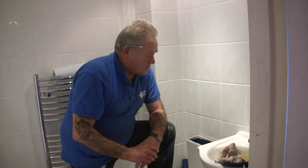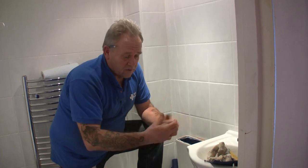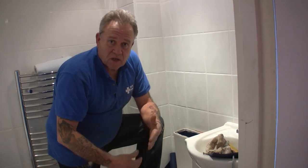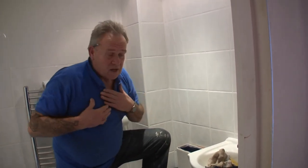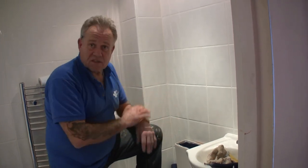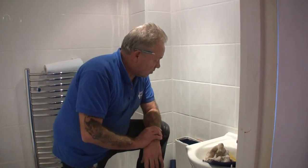There we have one lined toilet cistern. It's really important that the mastic is given 8 to 10 hours to go hard before you refill the cistern. That's because it's important that the neoprene, or whatever yoga mat material you're using, is completely stuck to the inside of the cistern. Because some water will force its way up between the cistern wall and the mat, and that's a good thing — it will act like a wetsuit, with water trapped between the neoprene and the cistern wall. That water will warm up and keep the cistern at a temperature to avoid condensation or at least absolutely minimise it. So make sure that mastic's gone completely hard — leave it for 6 to 8 hours, maybe a little bit longer if you can. And that's how to avoid condensation on the cistern itself.